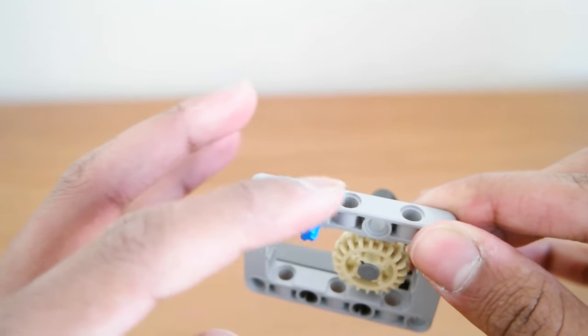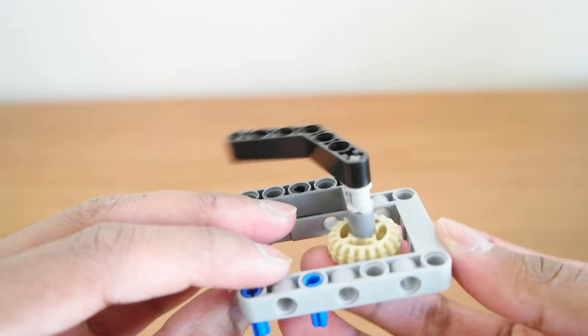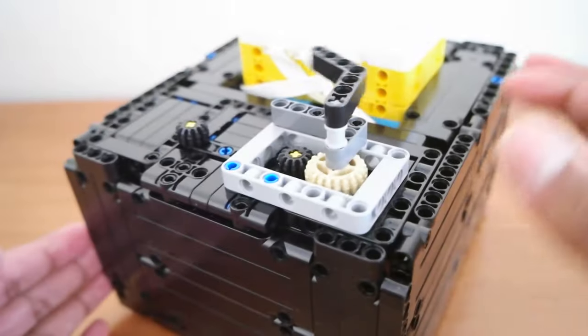By using the blue crisscross pins and a frame, you can see that you can slip attachments on and off the robot very simply and easily. The key is having another bevel gear — I've used the beige one on the side — which helps mesh with the black one on the robot. As the black dog gear turns, the bevel beige gear on the attachment side also turns. This is super helpful and quick when it comes to swapping attachments. It also allows for a secure fit because the crisscross pins aren't going to come out unless the whole robot flips upside down, which is very unlikely in an FLL game.